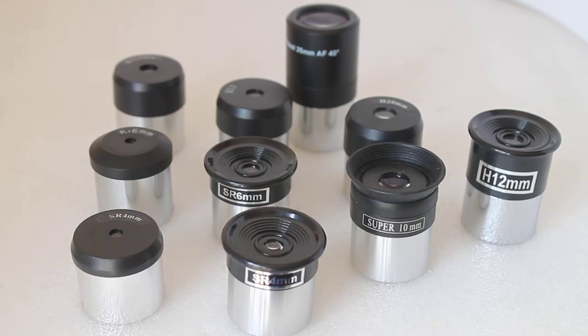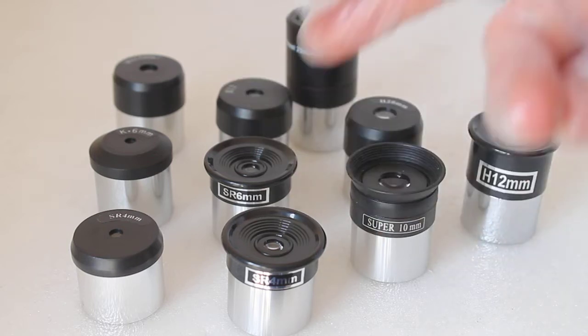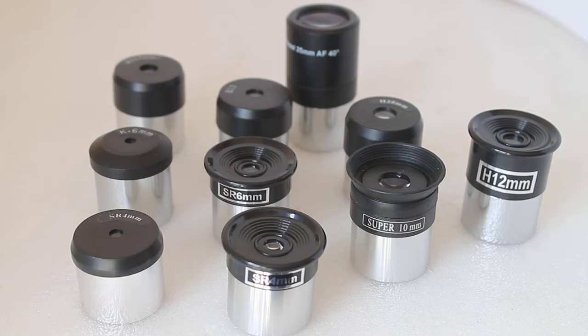All of these are twin lens elements. With the budget ones, they will use budget glass, probably not as dense as the higher grade ones, and they will use little or no lens coatings. The H is for Huygens — twin lens elements — and this is what you call a plano-convex lens assembly, so on each lens element you have one flat side and one convex side.